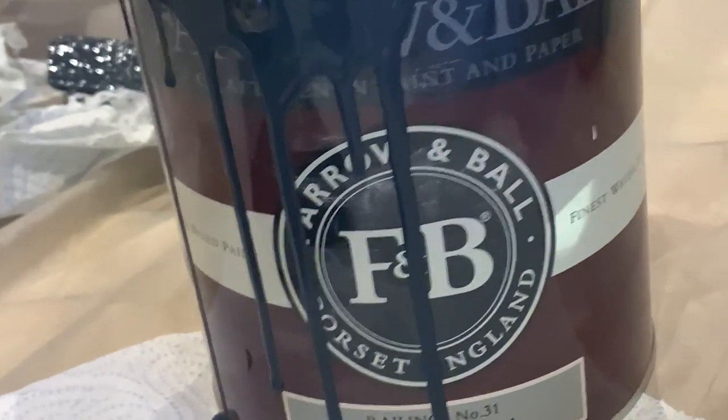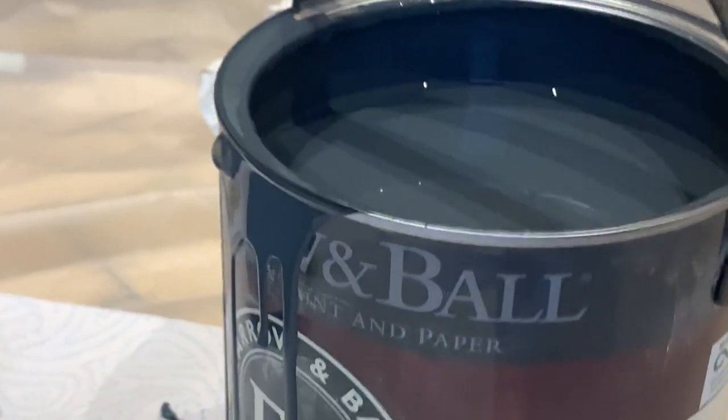I've seen some people literally use a heat gun and take off the vinyl layer that the manufacturer has put on and paint the MDF, which is a really good way to make sure that you won't get any chips, because you are painting onto raw MDF, so it will retain its color. Or the way I did it, I didn't want to do that just in case it was glue, and I didn't want to make it worse than it already was.